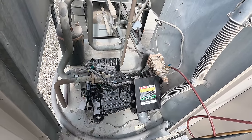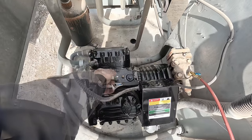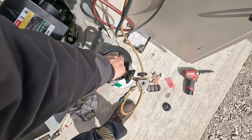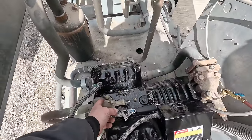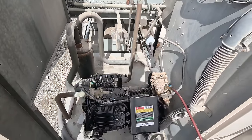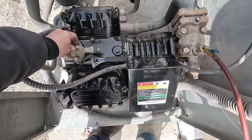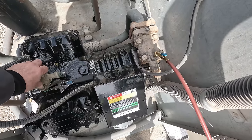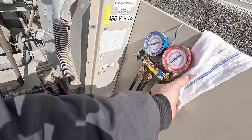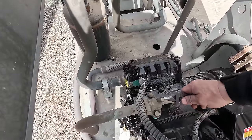All right, so we got everything back together here. We're going to purge nitrogen through the suction — it's going to come out through the valves right out the front here, and that's going to at least break any air we got in there. Then we'll start working on the other side. You can push through the valves no problem — hopefully pushes most of the air out of the system. Because these valves, the way they are when you're front-seated, cranked in, you're open to the compressor. Just to keep it in a positive.